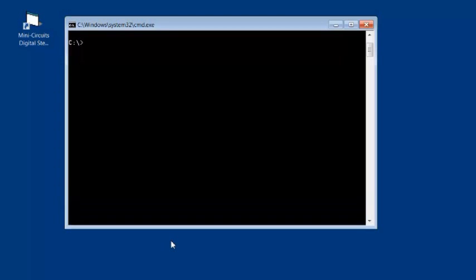As well as HTTP communications, which is what the internet browser uses to talk to a PTE, our device also supports Telnet. To demonstrate this, we can use Windows Telnet Client. Open the Windows command prompt and then type Telnet and then hit Enter. Make note of the escape character at the top, which is Control+close square bracket. We will need this to exit our Telnet session later.